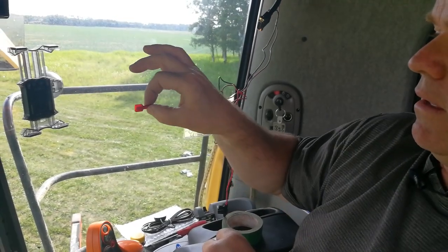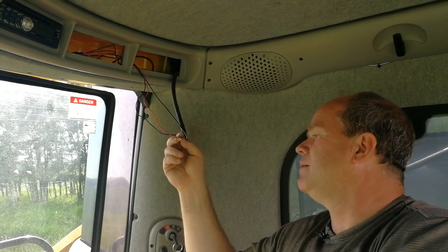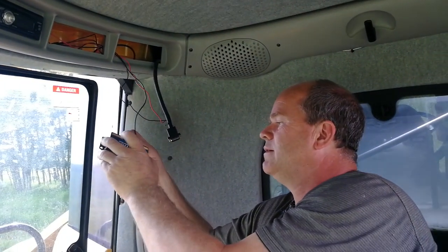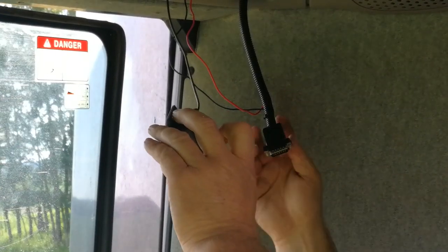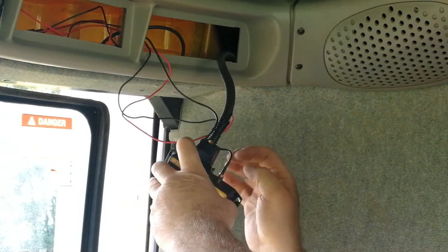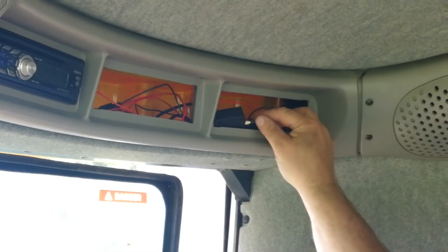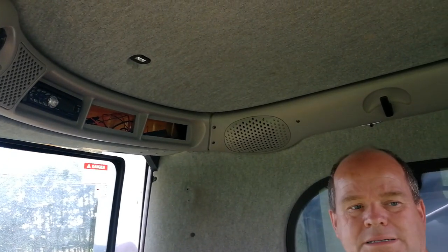Repeat that for the black ground connection as well. You need to sort out your antenna mounting strategy if you're not going to mount the data logger on the center line of the cab. In our case, we placed it up in the headliner forward to the light. Thread the coaxial connector onto the SMA connector on the back of the data logger. Plug the DB15 connector into the back and tighten the two screws. There's double-sided tape mounted on the bottom of the box for securing it in a fixed location.